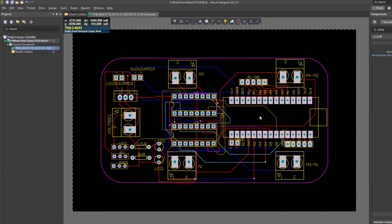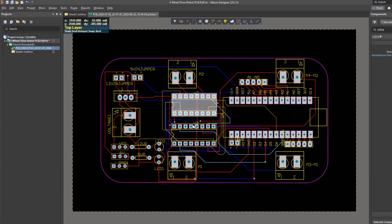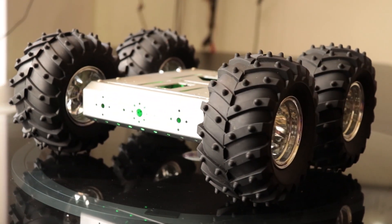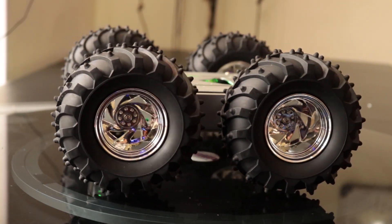Here I have designed a PCB layout where you can easily mount your Arduino Nano 33 IoT, L293D ICs and the supporting components and set this up without using messy wires and cables hanging around. This board is lightweight and can be powered using a 9V battery or a 12V power adapter. We need to power up the whole circuit and drive all 4 motors using L293D motor driver and our Arduino board.